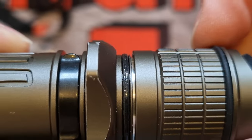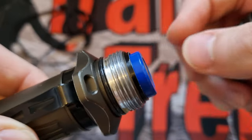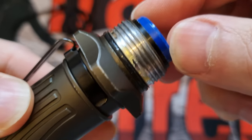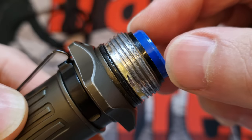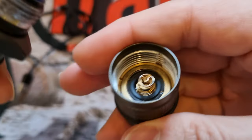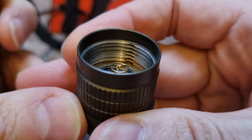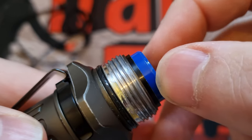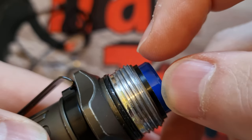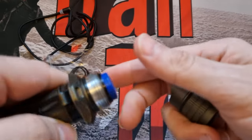So we'll zoom out there. And that is lubed, and you can see they use like a yellow lube, if I can find some there. Can you see it on the lower section of these threads? There's lube on there, which is nice to see, and everything's nice and tidy in here. Let's have a good look. Good thick threads, and they're not the really, really thin threads on here. They're sort of trapezoidal, almost rectangular. Good high quality ones that you're not going to come a cropper with.